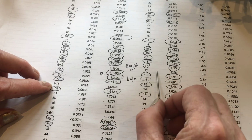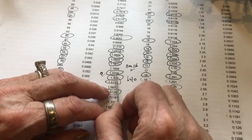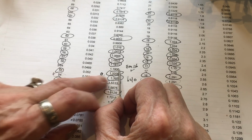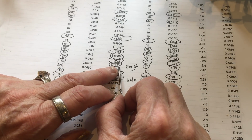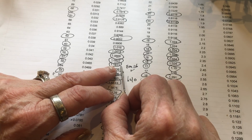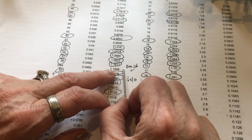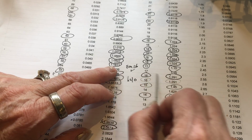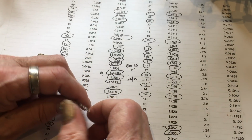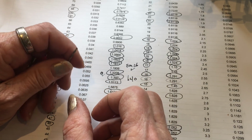But when you get up to 16 gauge, you've got a 1.291 on that. These two here are both too large. I don't have the 3/64ths, which I probably should get because that's probably the closest in size. And then the next one is the number 56 at 1.18. So I have to use a drill bit that's substantially smaller in size, which means that the hole has to be enlarged to fit the wire, or the wire has to be reduced to fit in the hole.